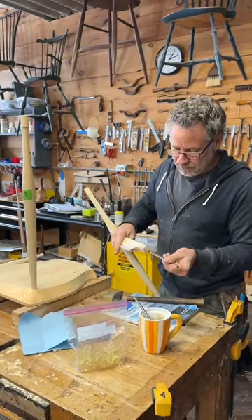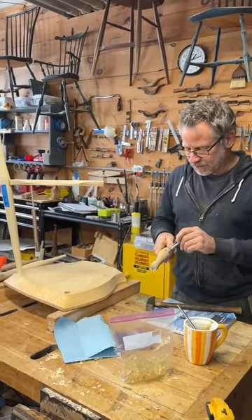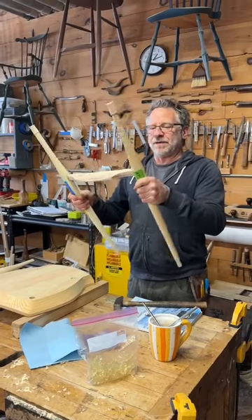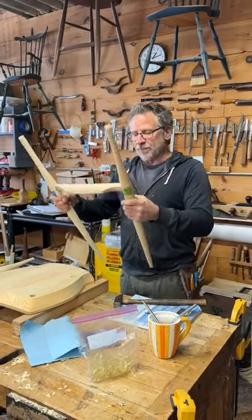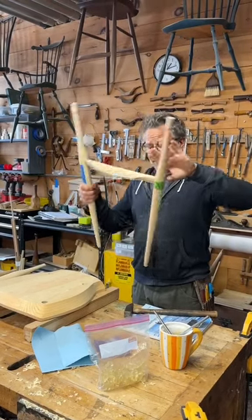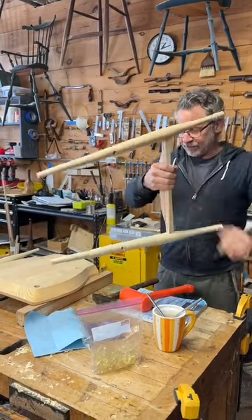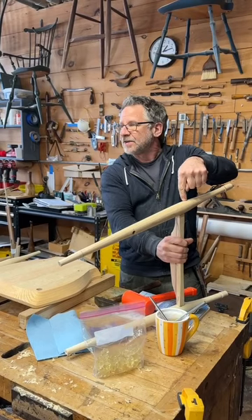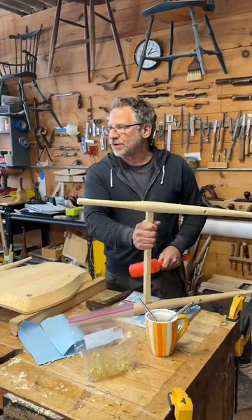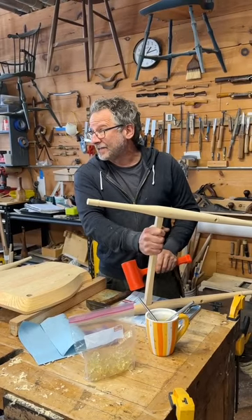Something I want to point out: whenever you're putting these in, you see they're going in at an angle. Often I see people trying to jam it in at 90 degrees because that feels natural — it's never going to go, and it's very likely going to chip something out. I'm not going to hit the wood directly here because it's hard; I'm going to use the dead blow. And I'm not going to hit it down onto the seat, because if I hit it a little off-center it could crack the leg. Think of the parts you're driving in like wooden nails — you drive the nail into the board; you don't drive the board down under the nail. Remember: this is the only joint that we're bottoming out.